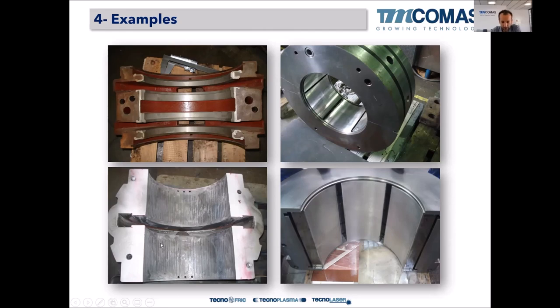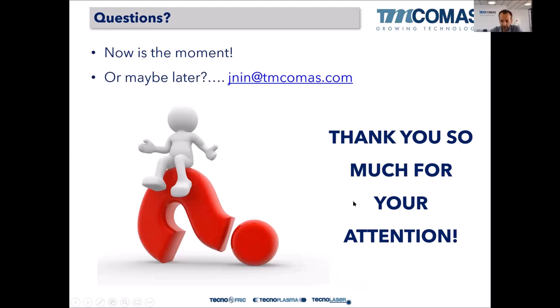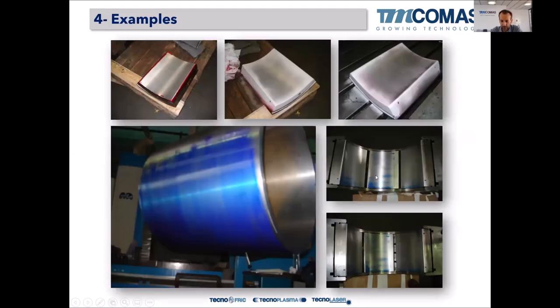And now it's ready to be machined. We have machined the split line. The joint in the split line is already machined, and now we have to machine the diameter, right? For example, the construction of some pads for a pad type bearing, in this case also manufacturing the mandrel blueprint. In this case, we were just at the beginning. Now we have to remachine and assure a complete blueprint, homogeneous in all the parts.